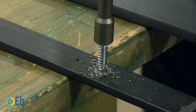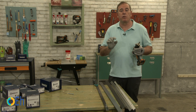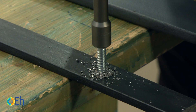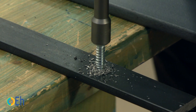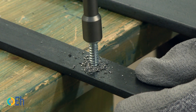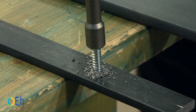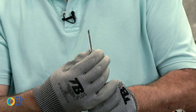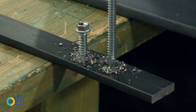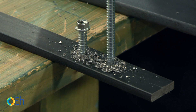What is happening when we drill with this screw? As you can see, we have managed to insert the drill without any difficulty, but the distance that the drill has made is not enough to allow the threading of the screw to be fixed. You see that it is turning, rotating, without making a way to enter. Even if it managed to get in, since I keep pushing the torque a lot, I run the risk that, as I am screwing with such a high torque, it may even break the screw. When the bit is adequate, we are drilling without difficulty and, once the bit finishes penetrating the entire thickness of the metal, it is when the thread begins to make its way and it threads like a normal screw.